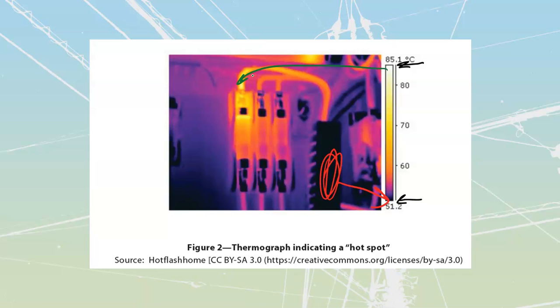These are going to be your best bet for doing non-contact, where you don't actually have to contact these wires over here. I know for a fact that this one is going to be overheated, but I've never yet had to actually touch that live connection over there. Throw the switch off of that one, go back into it, and at that point you'd be able to tighten this thing down. Chances are it's just going to be loose underneath this screw over here.